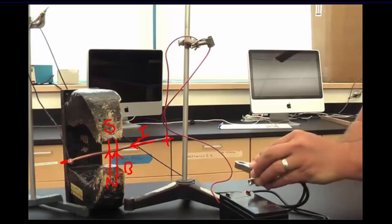Hopefully you made the right prediction. Using the hand rule: you've got your fingers pointing in the direction of the current, it's got to be your right hand, such that the magnetic field is pointing upward with the palm. If you do that, your thumb will point into the page with the force. Now there is another very common hand rule convention: you point your thumb in the direction of the current, get the fingers of your right hand going upward with the B field, and then your palm — which in this case points into the page — is in the direction of the force. Using either hand rule, your force points into the page.